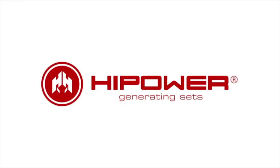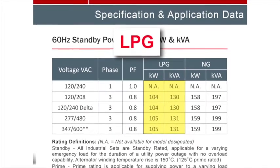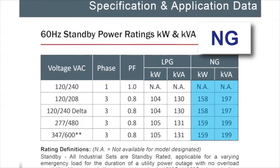This video covers the operation of a high-powered dual-fuel generator set configured to run on both natural gas and LPG. High-powered dual-fuel generator sets automatically switch to LP when the natural gas pressure drops below 9 inches of water column. Remember, when a generator set is running on LPG fuel, the power rating is less than when running on natural gas. LPG power ratings are lower than natural gas ratings for the same engine — consult the datasheet for the rated power.